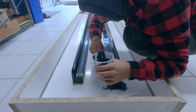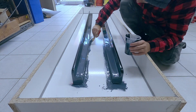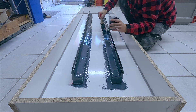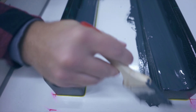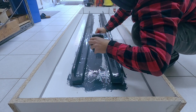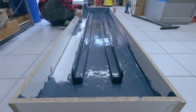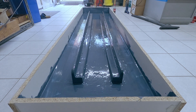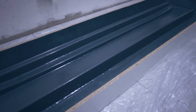I got a regular dark gray colored gel coat that you're supposed to spread evenly over the entire surface. It was my first time working with gel coat and to be honest it was not as much of a pleasure to work with as I hoped. Due to the cold temperature the gel coat was very thick and didn't spread as easily as it should have. I even gave it a dash of thinner so it would be easier to work with — not sure if you're supposed to do that but it worked just fine. After leaving it for at least a day it hardened to a rock solid surface, ready to lay up a few coats of glass fiber reinforcement.